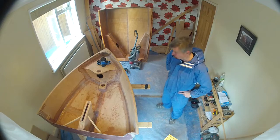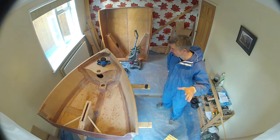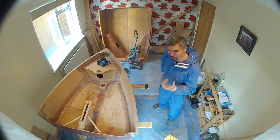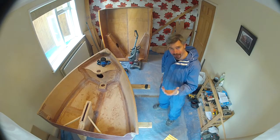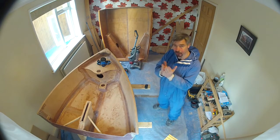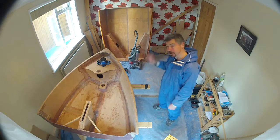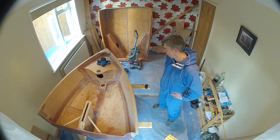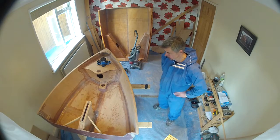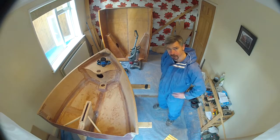So it's drilling through 6 sheets of fibreglass tape covered in epoxy, then through basically a 1-inch piece of hardwood, and then through some epoxy that was backfilling that, and then through the 1/4-inch plywood, but at the front there was probably more epoxy in the V, and then through another layer of fibreglass on the outside. So I just need to tidy up that outside section, smooth it off, and then I can get on with sanding the rest of the inside, and then I'll be ready for epoxying. Okay, better get going.